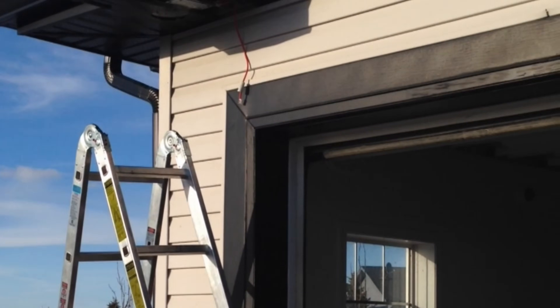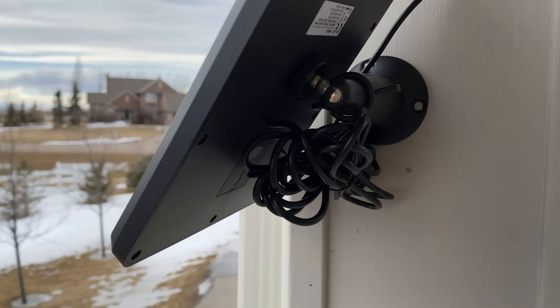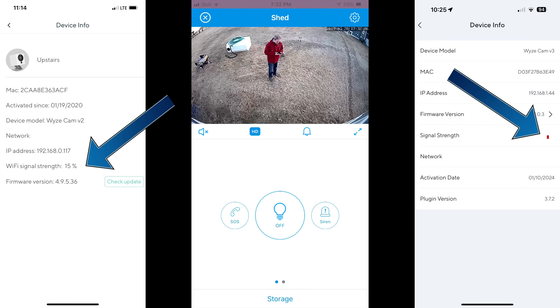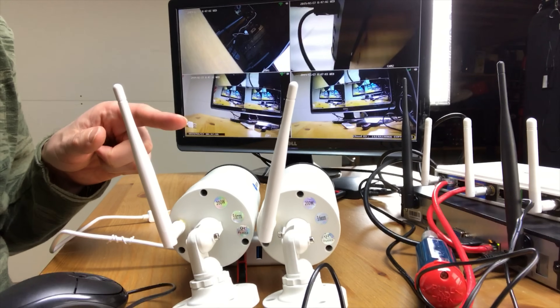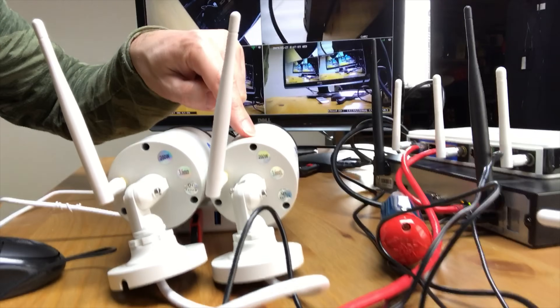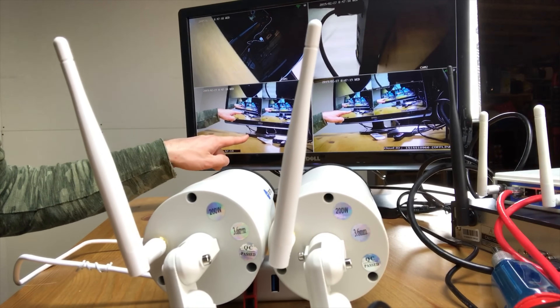The last one is a huge one and the most common mistake I see for DIYers: not taking the time or having the skill to run quality network cables to security camera install sites. It's tempting to rely on Wi-Fi and solar-powered cameras because they are convenient, but the shortcut can hurt the overall reliability of your system and will limit you on certain types of cameras, styles, and functions. If you have poor or inconsistent Wi-Fi signal strength at camera install sites, you could be missing frames or experiencing lag. Check out the difference between the wired and wireless lag on this system — the wired camera is clearly ahead of the wireless one, and already you can see there is a lag problem.